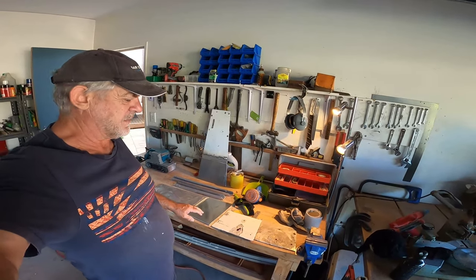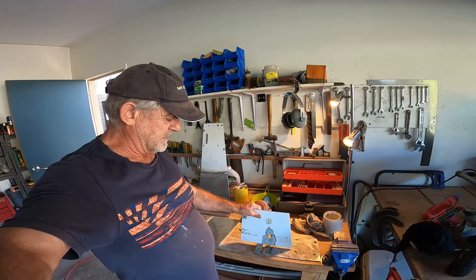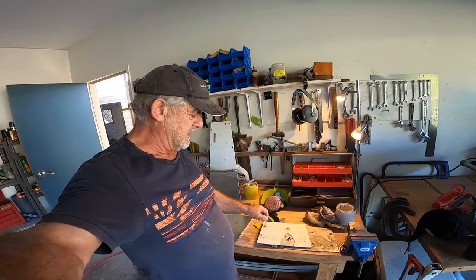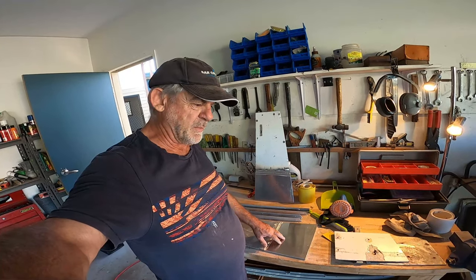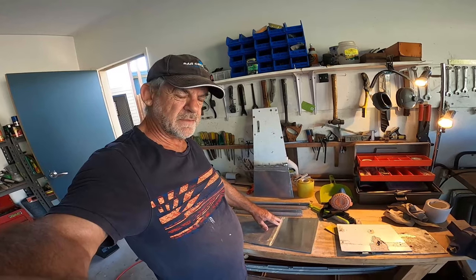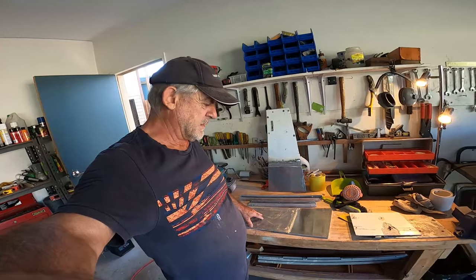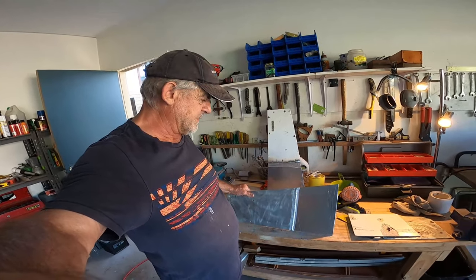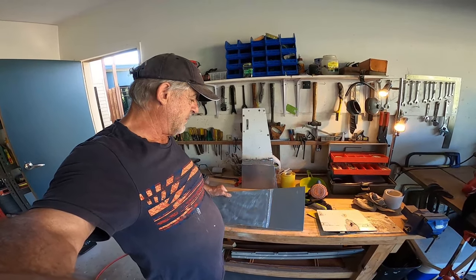There were significant amounts of damaged, corroded metal that I've removed — the pieces where the cancer had taken hold. I had some 6mm plate welded on here to extend it back to its original size, whereas the original plate was 4mm, so it's going to be a bit stronger than it was originally. Now I've just got to redrill some holes and clean up and prepare the surfaces ready for painting.